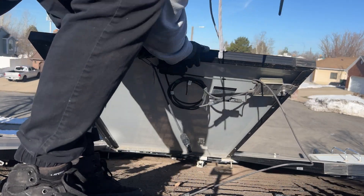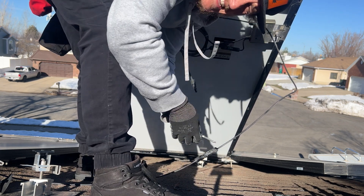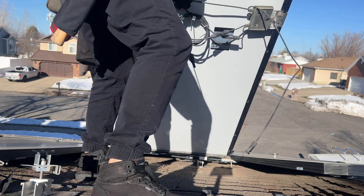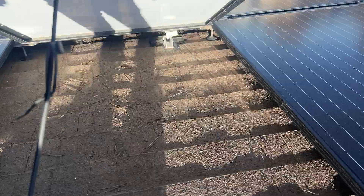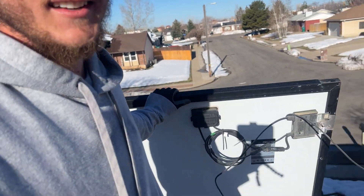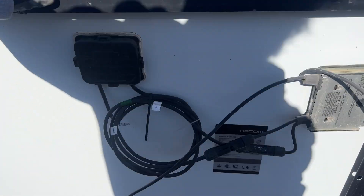I'm loosening all the hardware on these, and then the solar panels are connected with these PV wires. You can just disconnect them with your hand, but I have a little tool where you kind of slide it in here and pry them apart. One of the problems I see is the wire management. If you just look at this, these wires are just coiled up, slapping on the roof with a couple of zip ties. Wires are just on these little zip clips that don't really hold them up very well. I'm going to redo that because you can do better than this. I'm going to fix all this.